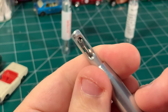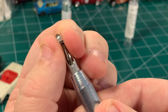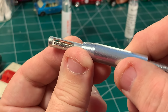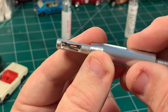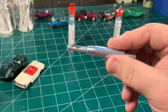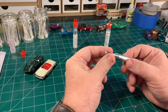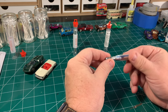Okay, and then you could start drilling, and as you started drilling, you'd push, and the drill bit would actually come out from the middle of this bit through that little hole there, okay? And as long as you use the same Vix bit, the same template, and the same hole, you could go through every cabinet and have perfectly, identically placed, self-centered holes. So I pulled one of these out, and I thought to myself, well, maybe there's something here that could help me come up with a way to drill out these cars, because really that's the problem, is centering and keeping centered the drill bit on the rivet of the car.